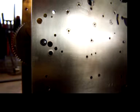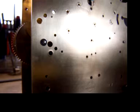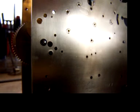And when I pounded it in, I found that the bearing did not want to turn at all. I stuck various objects in it trying to get it to turn. It didn't want to. So then I had to take it back out, and then I used a reamer to ream the hole out some more, and then I got it where it would practically fall in. And then I took a toothpick and I smeared a little bit of red Loctite in there. That's what Mark recommends, and pressed the bearing in so it was flush with the inside of the plate.